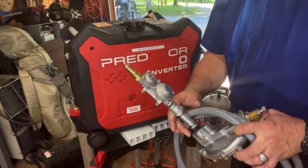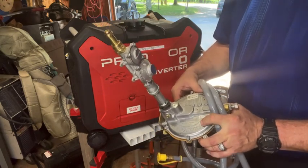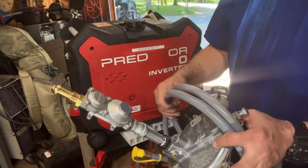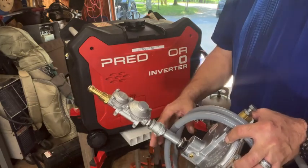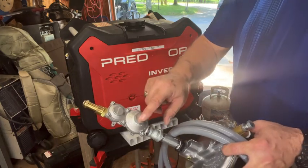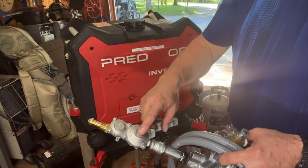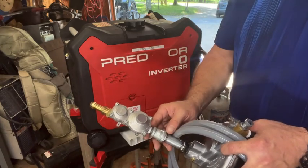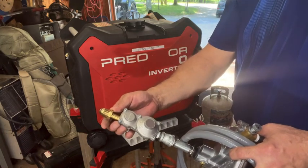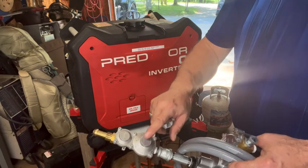One other thing I want to talk about is the regulator. This is the Garrison gas valve. I was going with a single stage regulator and found that depending on hose position and length to the generator, they were very inconsistent and the BTU throughput wasn't high enough. So I picked this up for $25 on eBay — it's a two-stage. I can switch now from the Honda to the Predator without any issues and no adjustment changes. Most importantly, she'll go to eco mode on the generator and back without an issue, where before they would stumble and sometimes starve. So this is a good investment.